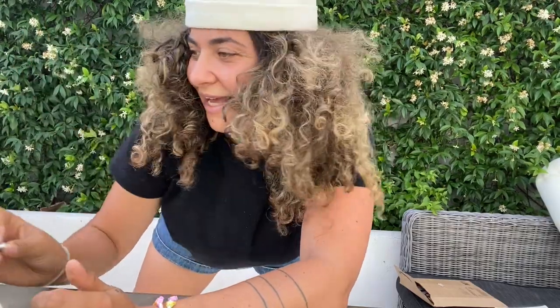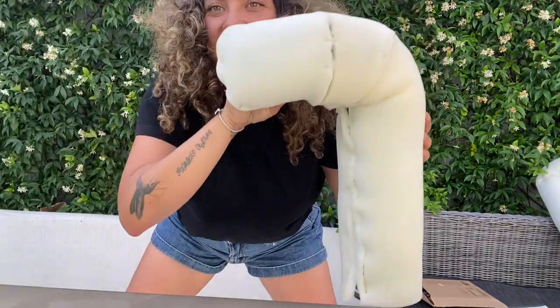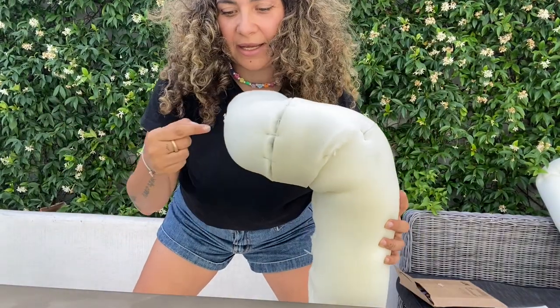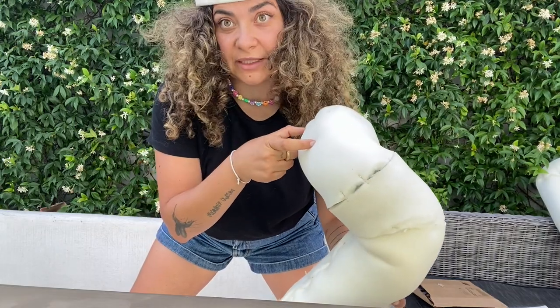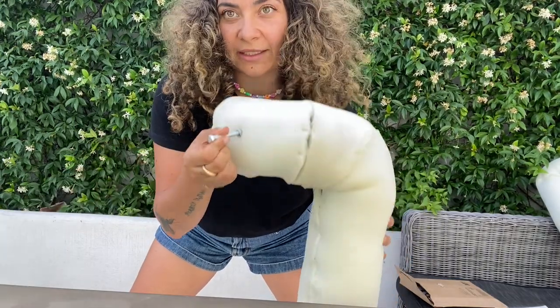Like this, and we are gonna make a hole on the base leg after the spot of the connection, so a bit more deep, like 5 centimeters later, so that after we can connect the two legs together with this, and it's never gonna open aside. It's way stronger than any glue that we could find, and we need this on two strategic spots.